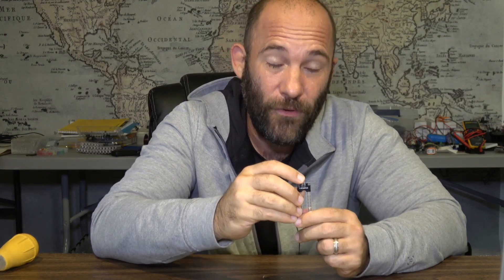There are other issues people have with these sensors. A lot of people call them toy sensors because they corrode relatively quickly — since an electrical current is constantly passing through the soil. How quickly that happens depends on the environment, soil composition, and moisture level. One thing you might consider to extend sensor life is to power it using a digital pin rather than the constant 5V pin. That way you only send power when you need a reading, reducing corrosion from continuous current.